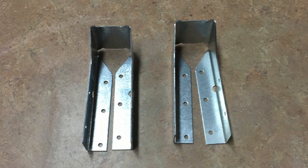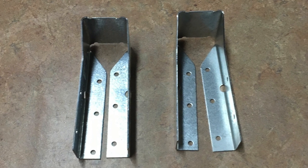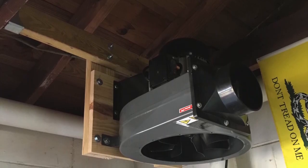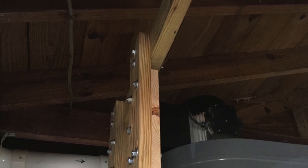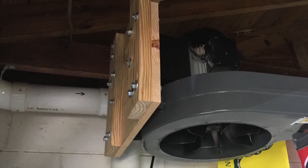We're going to switch gears for just a minute here and go ahead and mount the motor into the rafters. Here are the brackets that I used in order to mount a 2x4 up between the rafters — you can buy these brackets at Home Depot. After I got the 2x4 up into the rafters I built a simple mounting bracket to hold the motor. The mounting bracket is a simple 1x12 mounted to two 2x6s, and those 2x6s are bolted to the 2x4 that is between the brackets. Just make sure you have a friend that is strong like bull, because that motor is heavy and it takes two to lift it up there.